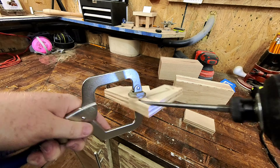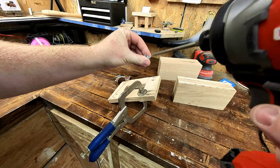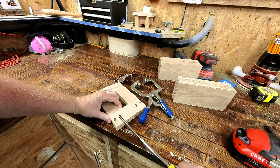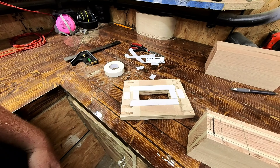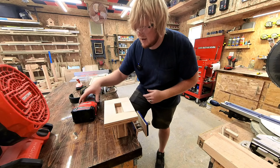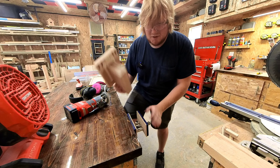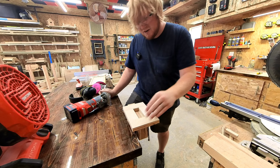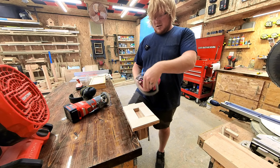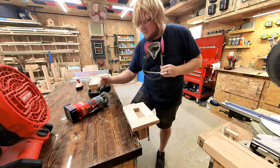Ensure the boards are flat against each other — I just use my clamp, but the router will be riding along the top so you want a nice flat surface. I use my impact to get the screws close, and since I'm screwing into the same direction end grain I finish them off by hand to prevent splitting or cracking the plywood. Using some 3M tape I lined up where I wanted to cut the slot and pressed it on top of my work piece. I'm using my quarter-inch flush router bit, set to not a super deep depth. I'm clamping it down in my vice, taking small passes until I reach the perfect depth. I do use a mask and noise-canceling because it's loud — I'll see you in a little bit, fingers crossed.